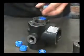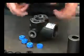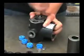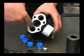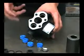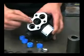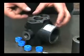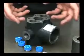You want to check all four of them. If the valve comes apart inside, you can take it out piece by piece. This is a good time to inspect the condition of the inside of the valve bore — you can run a wire brush through there to see any chemical etching more easily. Also inspect the surface on top of the valve bore for chemical wear. If there's enough wear inside the valve bore, the valve can actually move up and down while the pump is running, which will give you erratic pressure and start to wear the body to the point where it can't be used anymore.